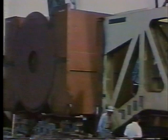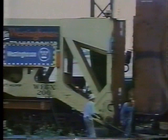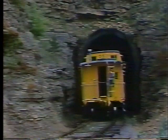A selected crew accompanied the move for two weeks, breaking apart the car and lowering and raising the weldment as necessary to clear tunnels. The car permits its load to be suspended between two identical end sections which can be pulled apart. Over the road, the load is lowered to minimum possible track clearance for tight spots. The tightest fit was a natural rock tunnel at Droop Mountain, where a bend brought this piece less than three inches from the rough rock tunnel roof and sides — and by this much the load passed through.